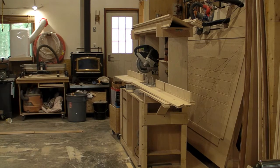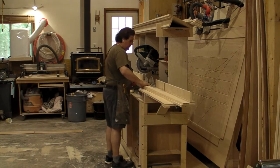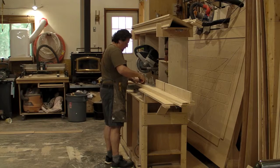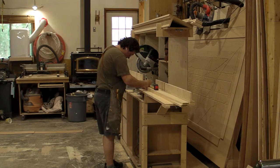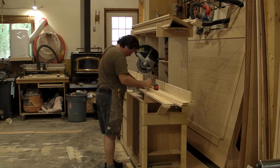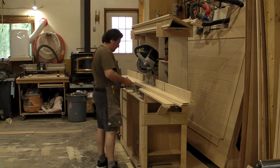Now I'm going to move on to cutting the rails, the top and bottom, which is 2'3" and a fat quarter. Oh no, I actually did these ones on the nose, 2'3" and a quarter. Once I've cut these, because there's only two of them, then I'm going to cut the toggles. And the toggles are that dimension, 2'3" and a quarter, minus 2 thicknesses of pine.